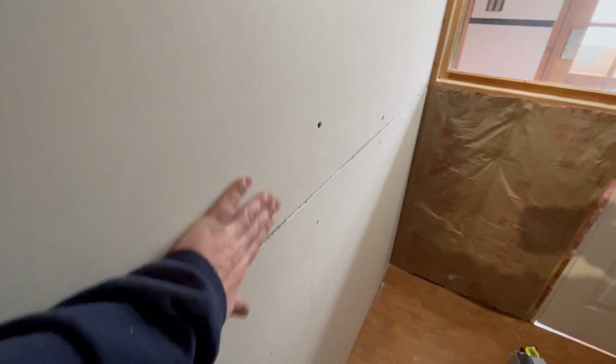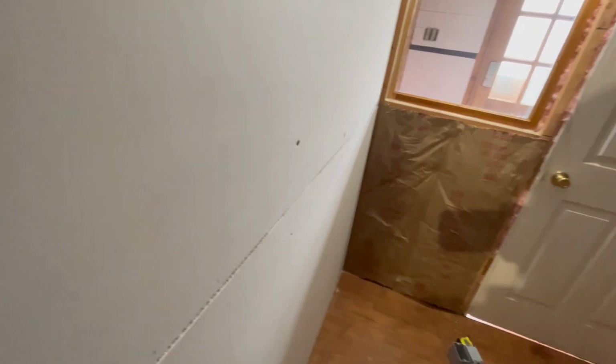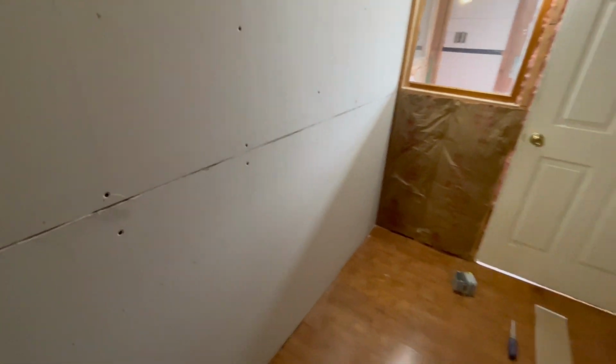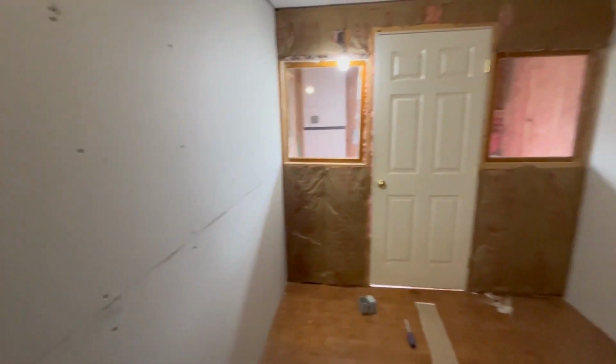And you can see this side is tapered, this side is not. That's why there's this edge here. But with the joint compound it'll be filled out this far, so it won't make a difference anyway. It would be better if you could put your cut edge on the bottom, so that way you had your two tapers together. But in the real world, it's not always going to work that way.